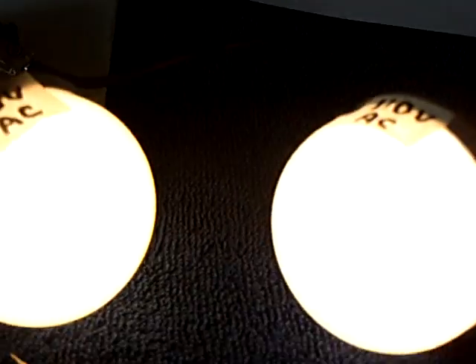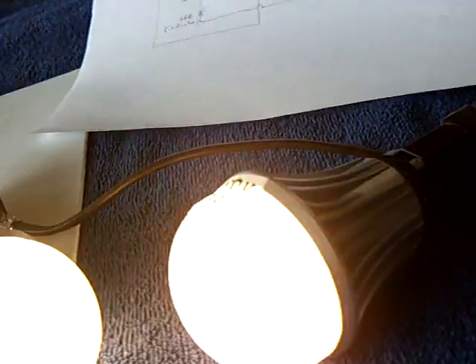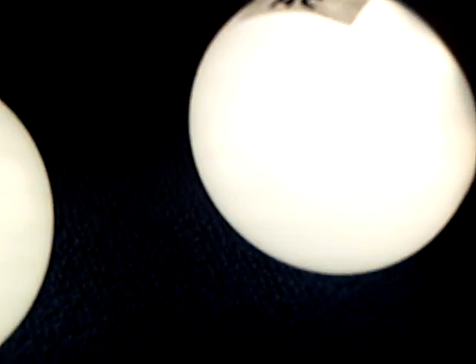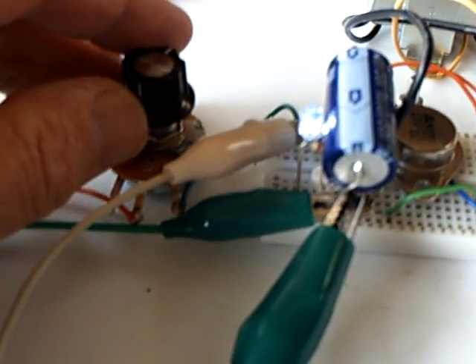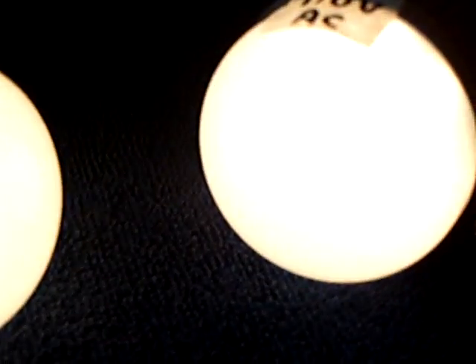This is something else I wanted to show: I can listen to it with my radio and hear the frequency coming off these bulbs. If I move this rheostat around — which is what I'm using to control the input power — you can listen to the frequency vary. I'm just turning this rheostat down. This is a RadioShack 25 ohm wire-wound rheostat — I've used it on other projects. It gets hot, so I'm just using it for testing. You really need a voltage regulator, but it does make an interesting dimmer switch.